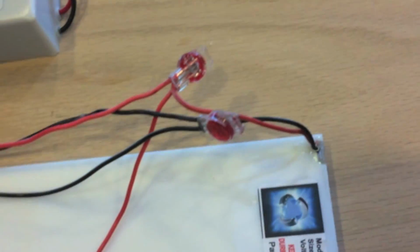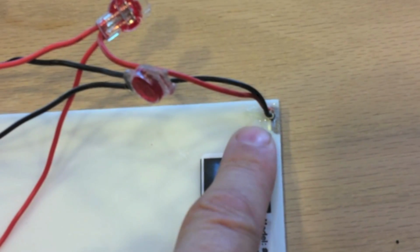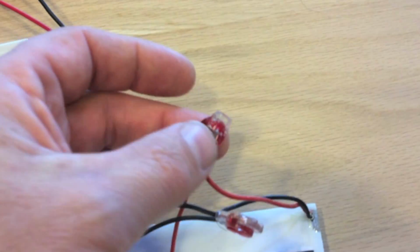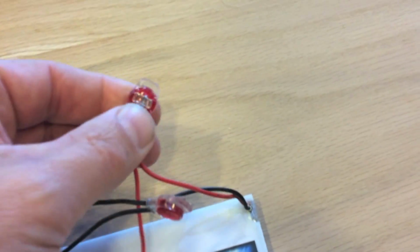One other consideration is the fact that the wires come out of the panel coming straight down. So the only way we can accommodate that in the plywood is to drill a small partial hole. We're going to use a paddle bit so that the wire has room to go down into the plywood before it turns into the channel. Also, all the wiring is going to be done with 18 gauge wire and these little push pin 3 wire butt connectors. You strip each wire, press it into the connector, and then with pliers squeeze the red dot, and that makes a good connection.